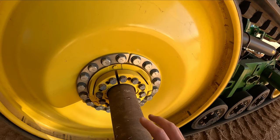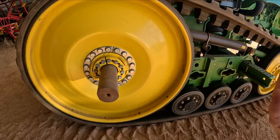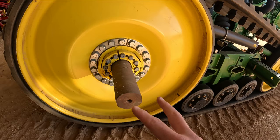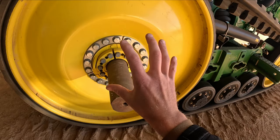Basically you screw those in somewhere and that helps you break the wedge off the drive wheel so that it's loose and it can be moved. Once that's loose and those are out, this thing can essentially be moved. When I spoke to the dealer, they said the easiest thing is to stick a forklift down in here, take the weight of this track assembly, and pull it out. They said that tool is really handy for holding the drive wheel in position while you're tightening up the wedge.